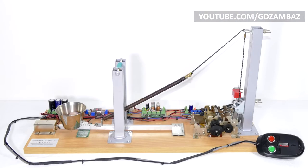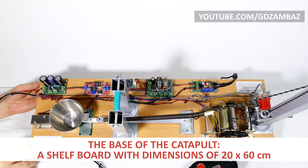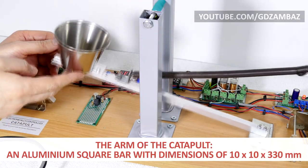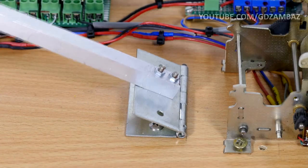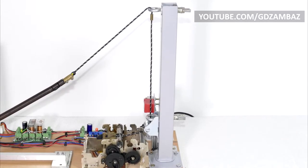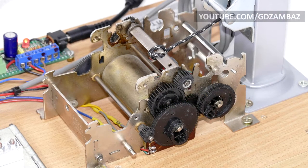Now let's do a quick overview of the main parts and the electronic modules of the catapult. As you can see, as a base I'm using this shelf board, and all mechanical parts and electronic circuit boards are mounted on it. The arm is made of a hollow aluminium square bar with a metal cup on the top that serves as a basket for the payload. It's connected to the base with a door hinge and coupled with an extension spring with a metal angle bracket. The other end of the spring is coupled with a string, which is guided through two metal hooks and tied to a shaft that is part of the geared motor assembly.